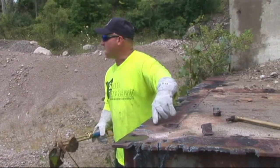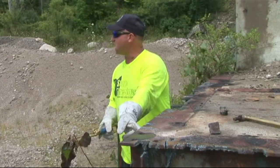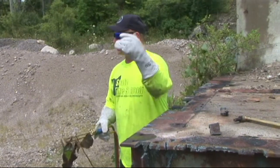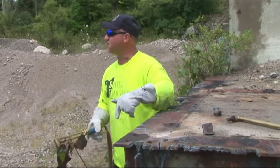If you look at my cut — when you've got a good flame, good cut speed, and good distance, it almost looks like you cut it with a saw. There's not a bunch of slag leaking down, it's not messy, it looks real nice and neat.